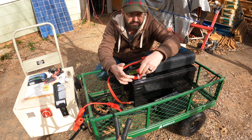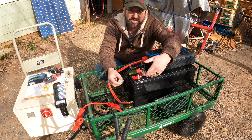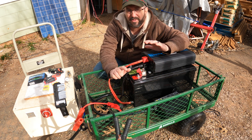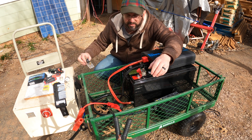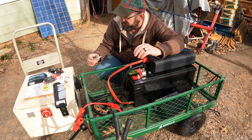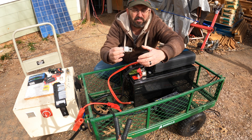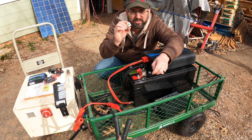You are going to have to do this important step. I have a fuse on here — this is a terminal fuse. This is a 100 amp system, which is why I'm using a 125 amp fuse. You have to have a fuse in here — some way to separate the battery from the rest of your system. That applies whether you're building a simple system like this or something for your entire house. You could use an ANL fuse, or you could use a Class T fuse, which is the gold standard of fuses. However, for a simple 12 volt system like this, the terminal fuse works well. You have to fuse it with something.